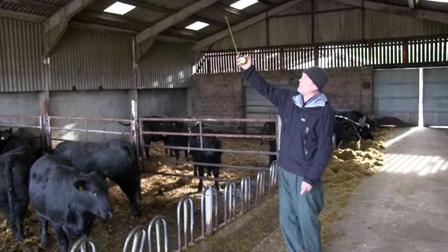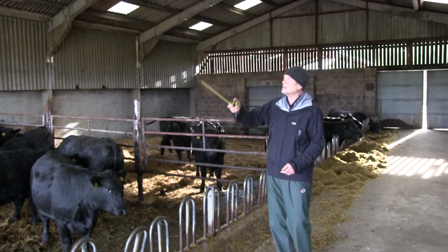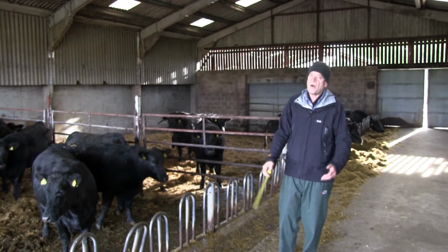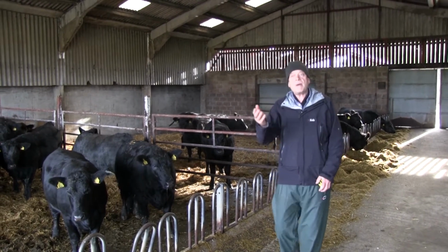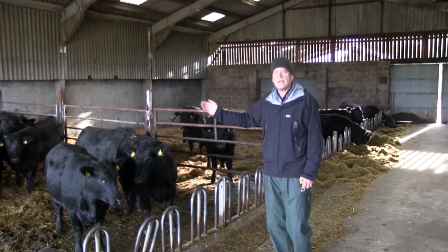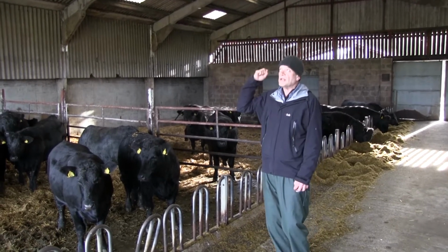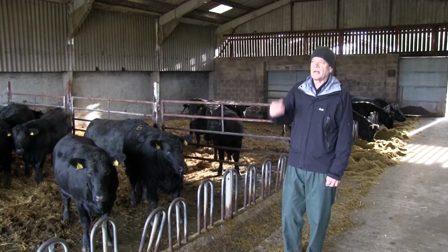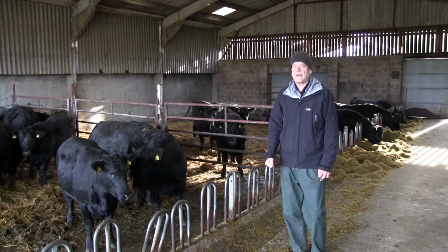What we've actually got up here is 20 of these cranked crown ridge sheets at 0.067 square meters each. So we need about 8 square meters. What we've actually got is about 1.3 square meters. These are completely tight up top. The thing about that for these cattle is that if there's hole in the roof, because there's so much heat and energy to drive the ventilation system when the wind stops, you will get a huge amount of air moving through, and the moisture and the bugs can go through the hole in the roof if there's enough of it. What we've actually got here is less than 20% of what we need.